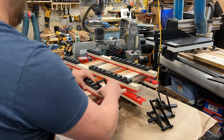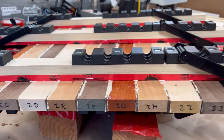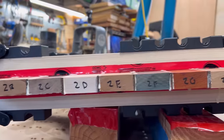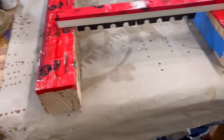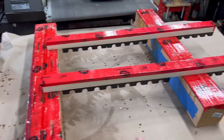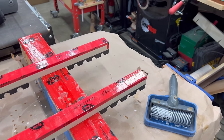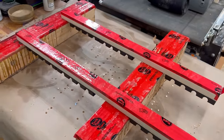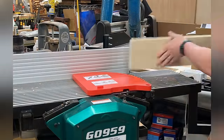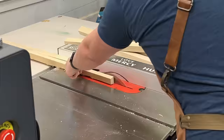With these clamps you don't have to mess around adding cauls or other things. For a wider panel I used three sets instead of two. You can see how flat it is — that's the idea of cauls — but this adds the perfect amount of pressure for great, really flat results, saving you a lot of material. One tip: use some 4x4s covered in sheathing tape as a little rest for these clamps so you have space on the bottom and don't have to struggle getting them in place.